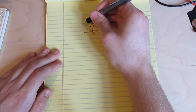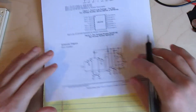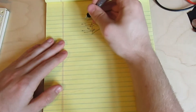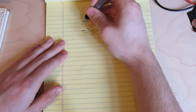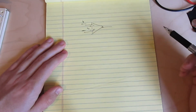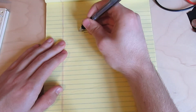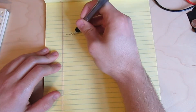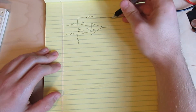There's also going to be some amount of current flowing into — or in this case out of — the inputs of the op-amp, because the LM324 has PNP transistors at the input, so current is actually going to flow out. There's going to be some amount of current flowing out of these inputs just to turn the transistors on at the input. That's called the bias current, IB. Now because of the same type of imbalance that creates this offset voltage, there's going to be an imbalance in the two currents — one is going to be a bit larger than the other. That's called the offset current, IOS. I'm going to characterize the effects of all these impairments on my circuit by computing the amount of voltage I'll need to give to the correction knob in order to cancel them out.